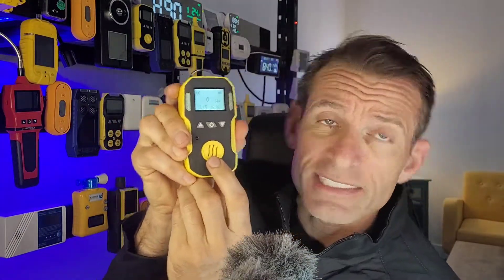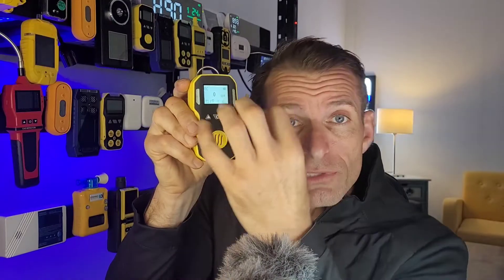Look, the little sensor element is at the front. The gas molecules diffuse in the air, the sensor picks it up, it changes the current, and then we present you with the calibrated value of volatile organic compounds. In most VOC gas detectors, they are calibrated to isobutylene.